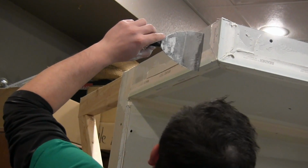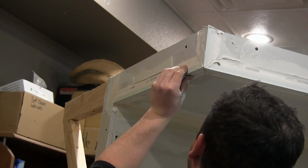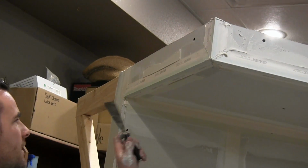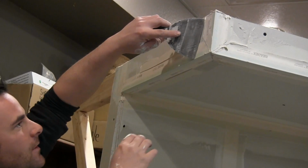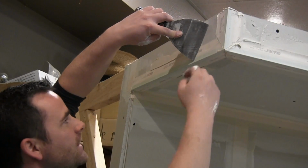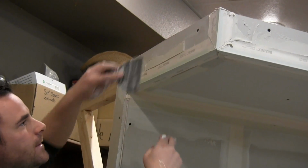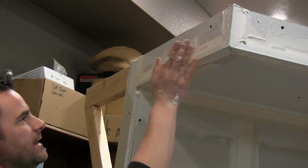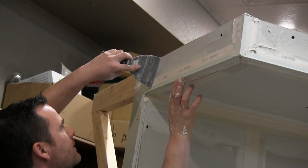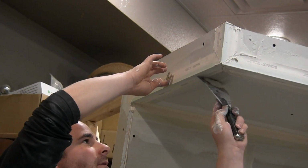Make sure I have daylight here. Good. See, I got to shift that a little. Good and good. Now, you can continue to wipe that way, or what I've learned to do is I don't wipe straight square. I just kind of angle it so that when the mud pushes, it actually comes up and out, right? If I go square, it'll just keep the mud inside that bead. So just angle it, go like that, and it's a lot quicker. But just do whatever way works for you.